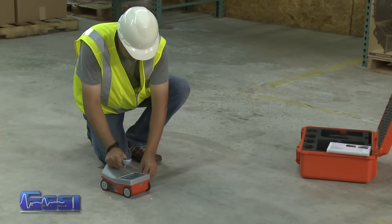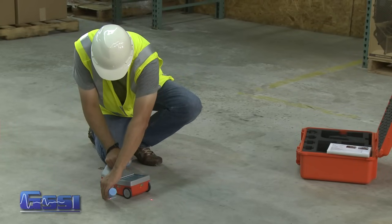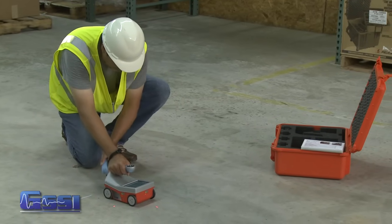To mark targets of interest, use the side lasers or the side groove as your guide. Push the cart forward to continue with the line scan. No data will be collected until you have passed the spot where you started to reverse.